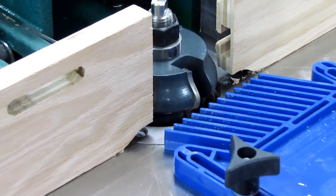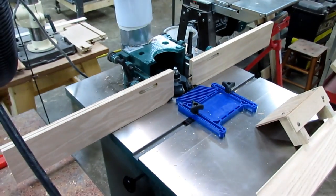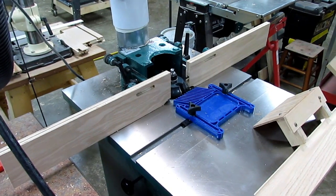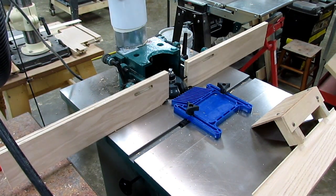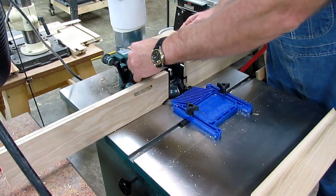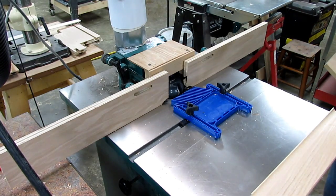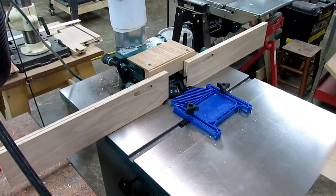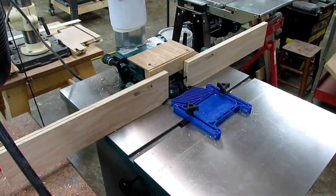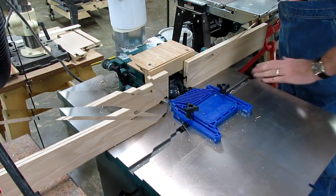how sometimes you can use cutters and bits and things like that for more than one function. Even though it was designed to make handrail, you just pull it down there a little bit in the table and only use part of the profile to cut what you need. And like I said, this cover here just helps keep the chips from flying out, because it does make several. Of course, it won't this time, since I already made one pass with it. But anyhow, I'll go ahead and let this go right here, and we'll make the final pass, clean it up, and be ready to go.